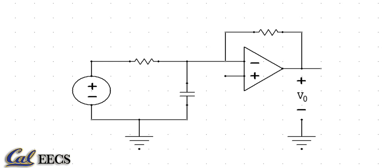On a circuit diagram, if we want some node to be at the same potential as ground, we simply attach a ground to the node, and we understand that on the diagram, all of these grounded nodes are at 0 potential. In a real circuit, if it's convenient, we link them together with a wire, but not in all cases. With these simple but important preliminaries, let us consider basic circuit prototyping.